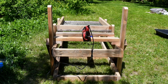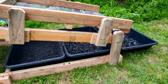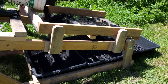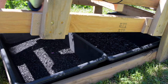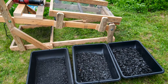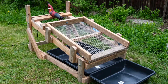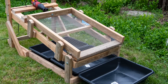The angle of this shaker table is adjustable to provide different processing speeds, while it sifts and sorts to three different sizes. The first screen is a quarter inch, so the vibration causes fine particles to drop into the first bin right away. Because the sifter tray is tilted, what doesn't fall through the first screen passes onto the second, half-inch screen, and falls into its own bin. What doesn't fall through that screen goes off the end and into the third bin. The bins are simple, inexpensive mortar mixing tubs, and a modular design allows them to be easily replaced.